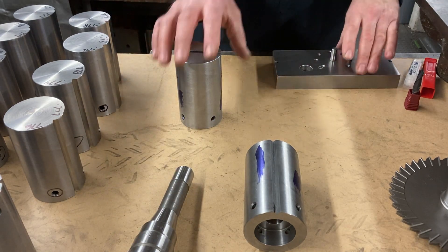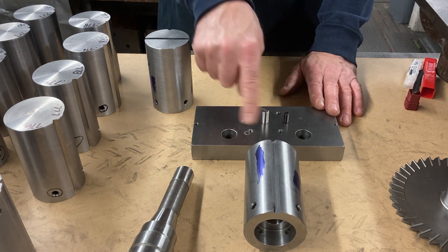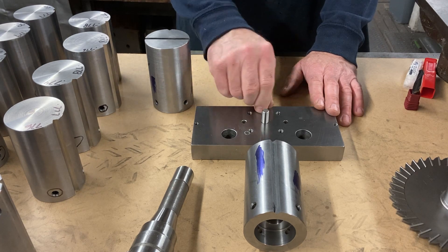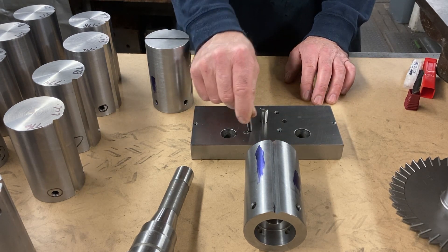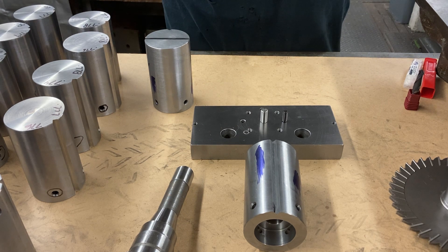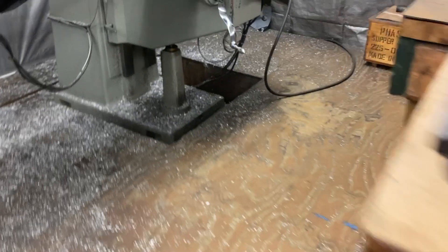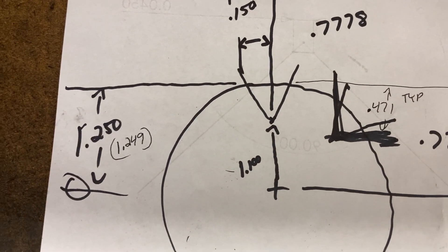What else can we do? We've got this plug fixture mounted on this dowel right here and you can rotate it. There are dowel holes in the vise and in the fixture to index the fixture 90 degrees, and the other vise jaw has dowel holes at 45-degree increments so we can index 45 degrees. If I would have thought of all this ahead of time I probably would have done it all on one jaw, but we're at plan X right now.